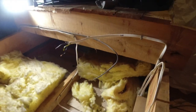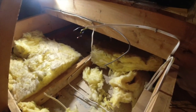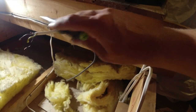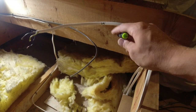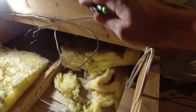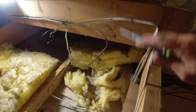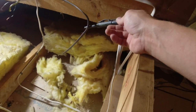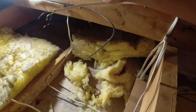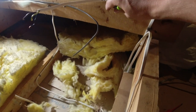James is just next to the van, he's gone to cut a bit of ply and we're going to drill a hole in it so we can oversize these holes in the ceiling. What I've done is clip the original switch line, which is a 3-core. So the brown will be our feed down, and then we've got black and grey, which we'll mark up with the brown. One will switch the fan and the three lights. One will switch the light over the sink. That's a feed from the joint over there, and then that's the original fan cable going out to the fan. And then this one's from the isolator, which will connect into the new Wago box here.